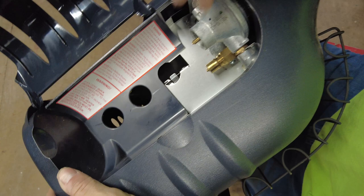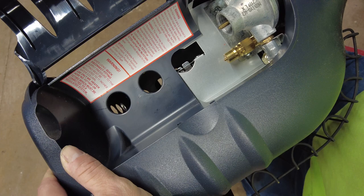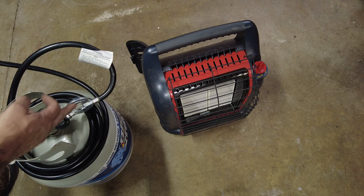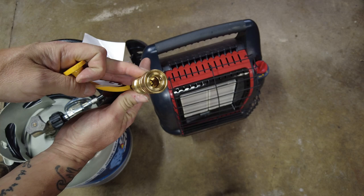But if you look right up inside of here on this side, there's a quick connect fitting in there. Mr. Heater thought of this already and I bought the hose that goes from a 20 pound bottle straight into that quick connect. I'll throw a link in the description to the heater as well as to the hose. Here's the bottle - you can see there's a regulator right there. It's got the big knurled plastic that screws onto the outside, and here's the quick connect. Pretty straightforward, just a regular old quick connect.